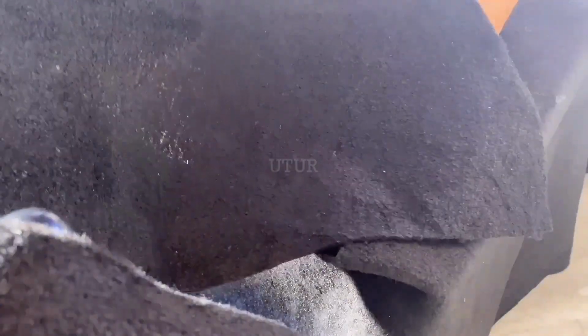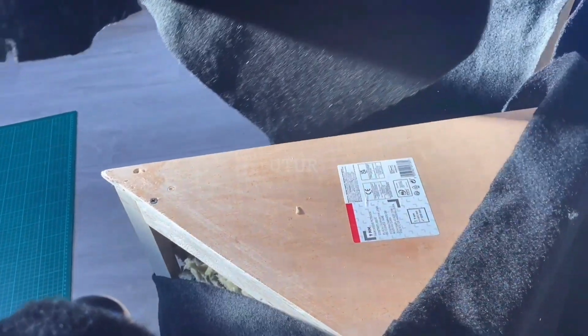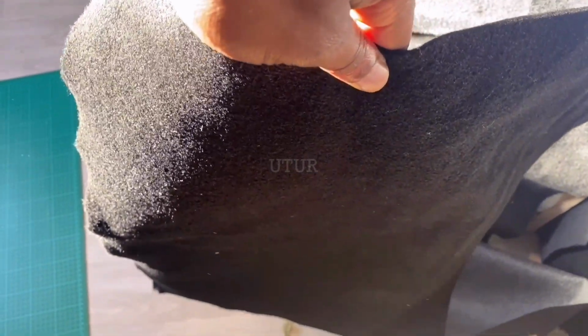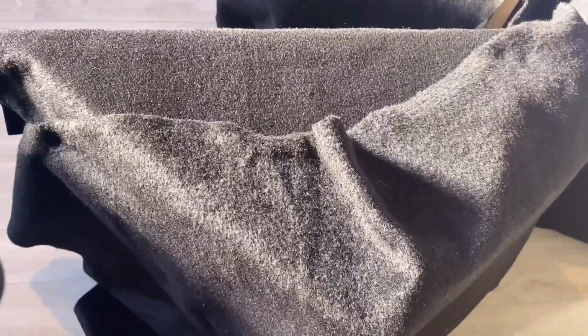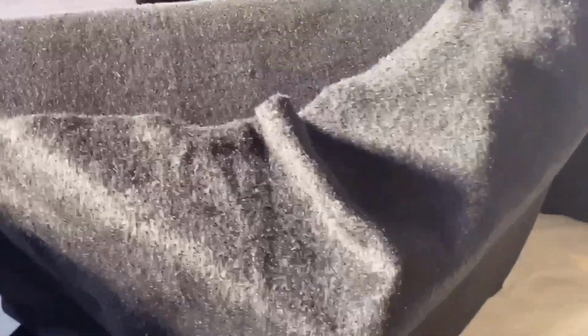And for both the top and bottom bases, measure the length and breadth of the diagonally cut hardwood plywood. So cut a square from your fabric cloth as opposed to a triangle, okay, so that it covers the entire perimeter of the top and bottom base, using the length and breadth measurements originally obtained from the diagonally cut hardwood plywood baseboards. So I have pretty much replicated the process for all 4 bass traps, ensuring that the dampening fabric covers the baseboards and the structure housing frames.